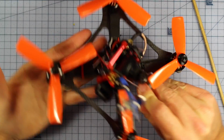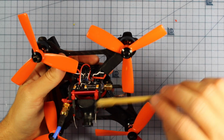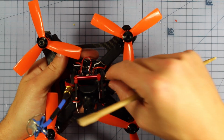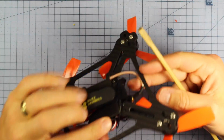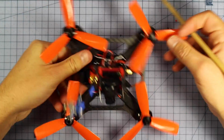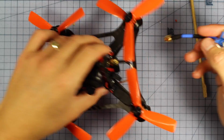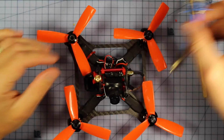If I had a smaller one, or if I could somehow make a bit of a change, it would be that there was some sort of VTX holder just here, and it would sit up perfectly, I guess, upright, and that's where your VTX would plug in and your antenna would come straight at the top. So if we could remove or drastically shorten the length of this pigtail, that would be great. Some of the other ones I've seen online, they actually run their pigtail down here out the side and they have their antenna out the back like this, but I decided to do mine this way.